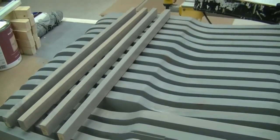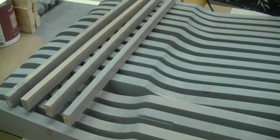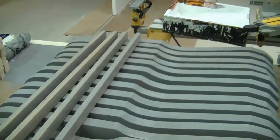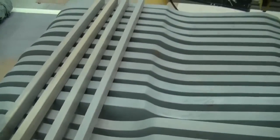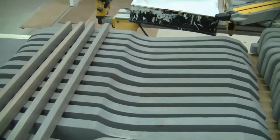So you'll notice that the 4 pieces that I've just done are slightly lighter than the others, and that's because they only have one coat. So what you would do is when they dry, you'd give them a very light sanding with at the very least 150 grit, possibly finer. And you would judge that by how much stain comes off. And you wouldn't sand too hard on the corners so as to take the stain off at that point.